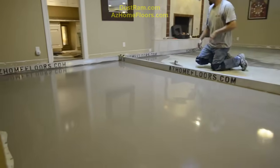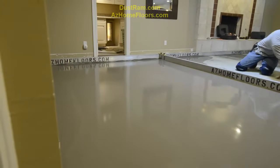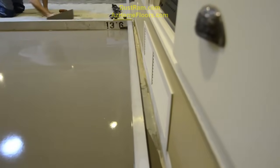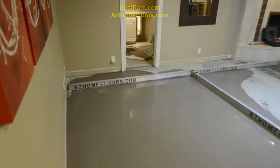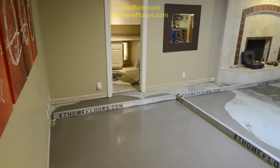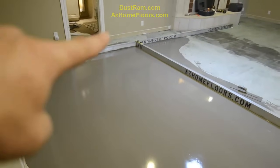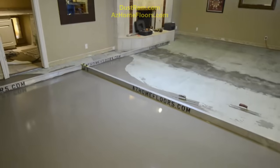This right here is about eight bags of leveler that we put down. Bear in mind we're still going to have to go around the edges. You can see right through here there's no leveler along the edges, and that leveler tapers away — it's not perfectly flat along those edges. But tomorrow after this really flat area is dry, we can extend the screed all the way to the edges, pour leveler, and fill all that in as well. So it's all done — this will be what they call a super flat floor.